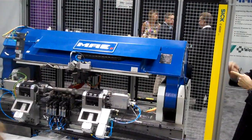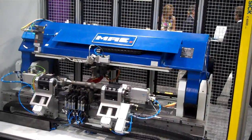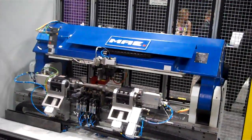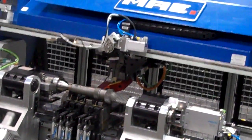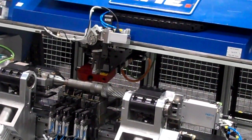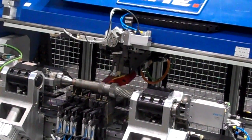You'll see on this one this red box moving behind it — that's a laser measuring system. It's been on the market for about two and a half years, it's field tested, and it's actually faster than using master gears. If you're familiar with gear measuring, to measure the run-out, oftentimes it's a customer requirement to measure it on the actual pitch diameter of the gears.